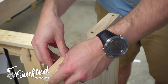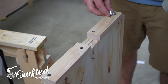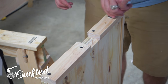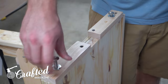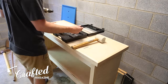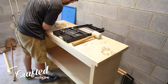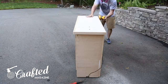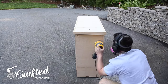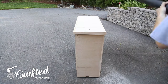For the feet I added some hardwood scraps from the trim and did the same thing I did on the miter saw stand I built previously — using T-nuts and carriage bolts as leveling feet. After installing the feet I marked the holes that the lathe is mounted through and drilled them out with a Forstner bit, using the holes in the chip tray that came with the lathe to lay out the holes. Next I sanded the entire stand with 120-grit sandpaper to remove any rough edges — mainly just to avoid splinters.